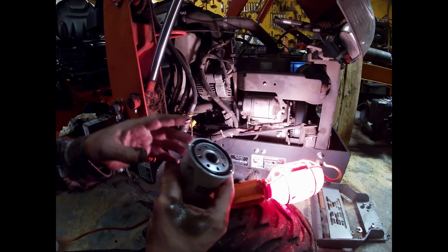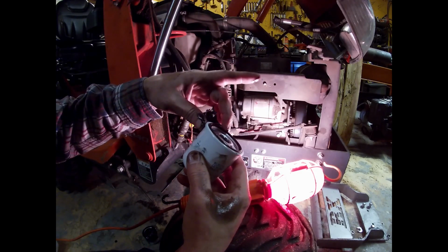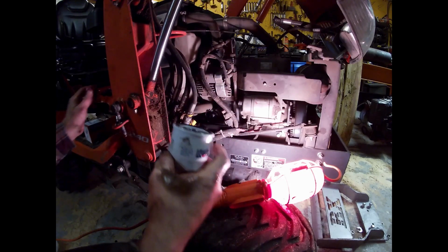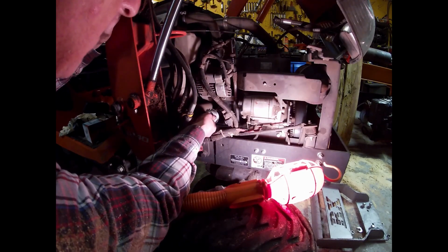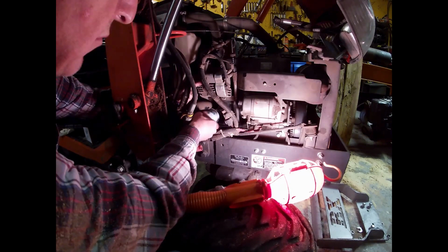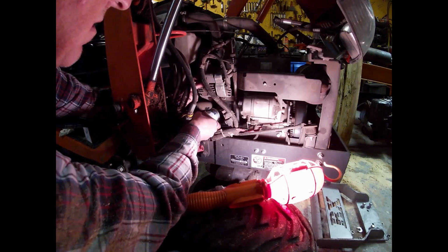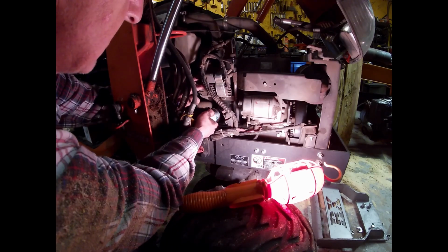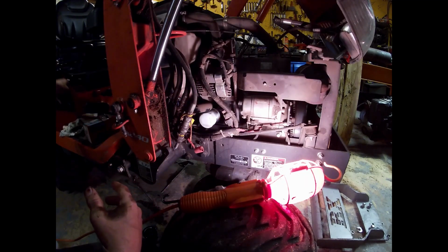They have a different seal on it. The seal is grooved, or it's rounded up, instead of the flat seals you get at Napa, and they fit in there and they hold in there and don't leak because of all the pressure in this little engine. It's not so much with your oil filter, but definitely with your hydrostat. And you don't need to get them very tight.